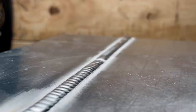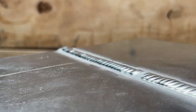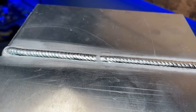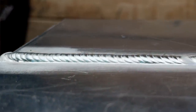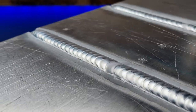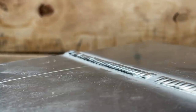Let's take a look at another photo. This is a butt weld and we can see it obviously does not look the way we want it to. We see lack of fusion on the edges and we see our filler material standing up way too high in the center. We may think that this is the problem — and it is a problem — but taking a look at the root cause, what is actually going on? Take a good look. Take a look at the overall stepping distance: things are stepped really close together, so close that it's not giving enough space for each puddle to blend out the way it needs to on the edges and fully fuse with the base material. As we step too close together, we are making the filler stack up too high in the center — essentially too much filler and each step too close to one another. We have too much filler piling up in the center and it's going to block our heat from doing its job. Allowing a little more space for things to blend and take the shape we need will then allow our heat to do its job properly — more spacing, allowing more heat to do its job properly.